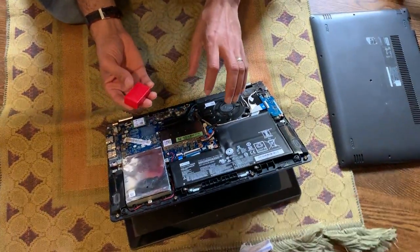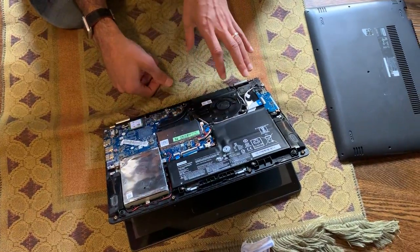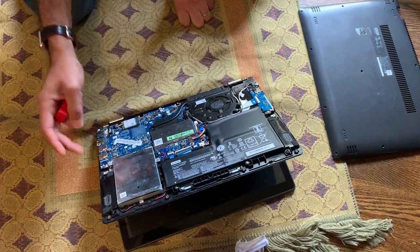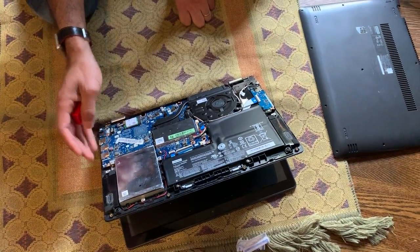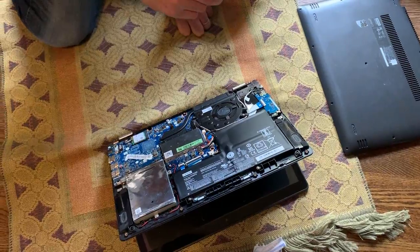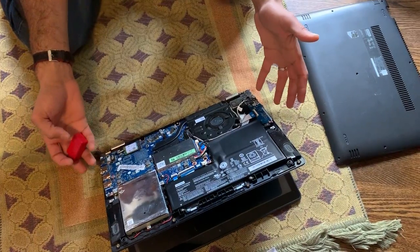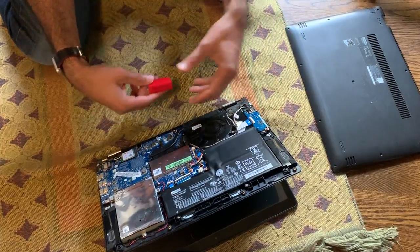With the board off, I was trying to replicate the problem away from the body — I just had the board and the battery separate. I put this magnet in the corner and was able to replicate the problem: it would not power on because this magnet was at this corner. That had me thinking that perhaps something within the body of this was magnetized somehow, and that's why it was not turning on. So I started putting everything back together.